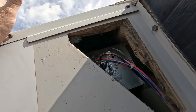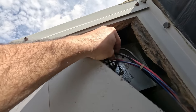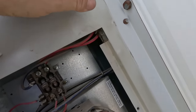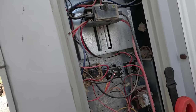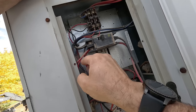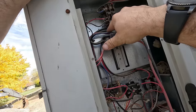So you're going to have about 22 amps apiece - that's 44 total. You've got a limit switch there. You've got two blacks coming in on one side of the wiring and two reds going on the other. Those come down to here, and I would not doubt that Jim Bob Jr. there said he could handle it. Here's your black - both black leads coming down to one side of the breaker. And the reds are going up here breaking both legs apiece. So each leg of that contactor is getting 20 amps.